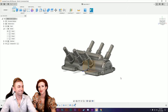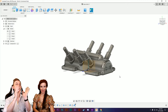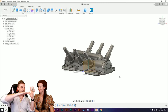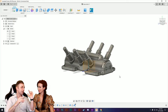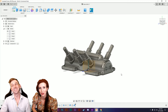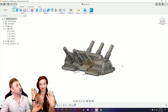It's a journey. So now we have to bring this component into our slicer, which will take the 3D model, slice it up into layers depending on the parameters that we give it, and then create the G code, which the printer can read. We are nearing the printing phase of this creative project, folks. Y'all, we're at about the quarter way mark.